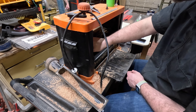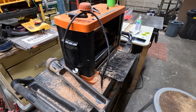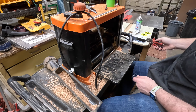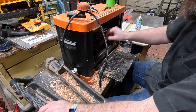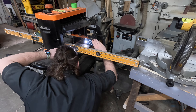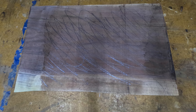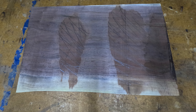About a week before I started this project, the Makerspace's planer went down — the motor went. You can actually see the DeWalt in the background torn apart while they were figuring out what's wrong with it. So my planer became the shop's planer while they sourced a new one. While I was working on my wood, I noticed it was causing a warp, so I did a full service on the machine, rotated the blades, and checked the bed. Now it's all cutting straight for nice flat glue joints. Between fighting with the machine and milling all the wood down, this step took me several hours, but the results turned out great.